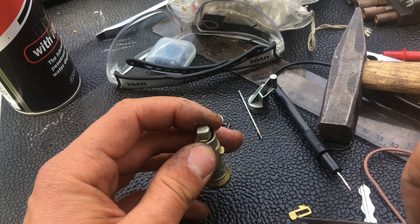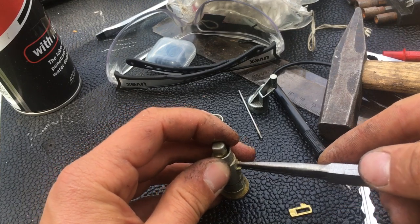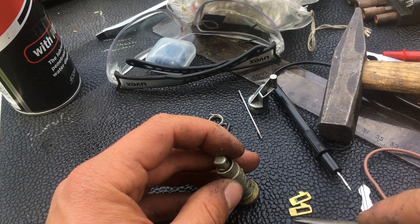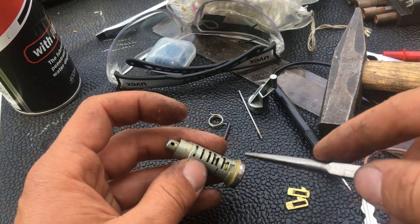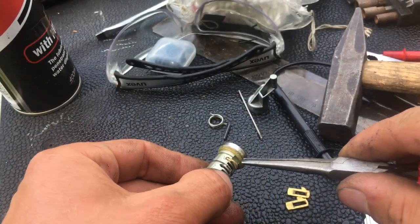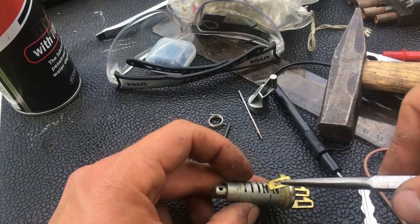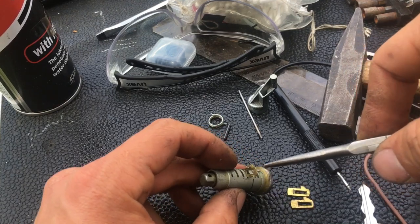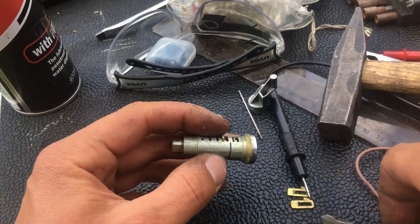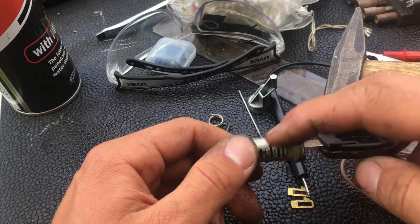All the pins have different sizes on this part. When you take them all out you can compare them — for example, this one has this part a bit shallower compared to this one. The pins also hold a couple of very tiny springs, so make sure you don't lose those either. Now it's pretty much just trial and error: put the pin in, put the key in — it's nice and flush on this side but it's sticking out on this side, so we can't have it in that position.